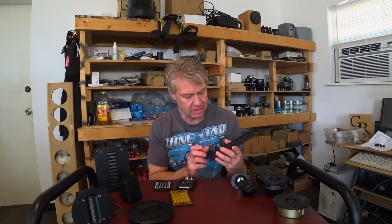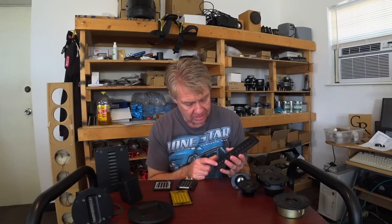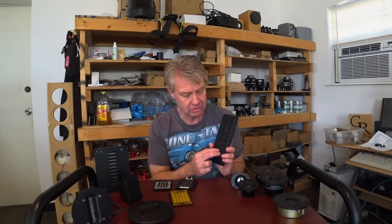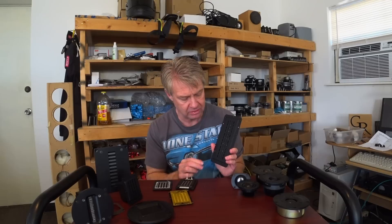This is a BG Neo 8 — actually a custom Neo 8 built for us for line sources. It has the PDR technology on the front side but not the back, with all five rows of magnets, keeping high sensitivity and wide dispersion. It really only plays through the two center holes, which is about five-eighths of an inch wide. The smaller the diaphragm, the wider the dispersion — as the diaphragm gets bigger, dispersion becomes more limited.